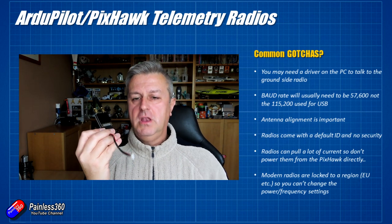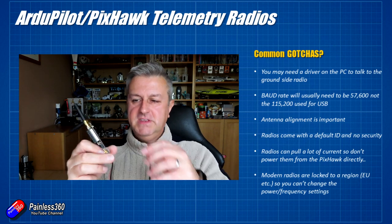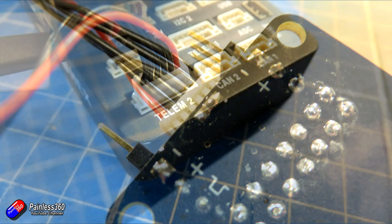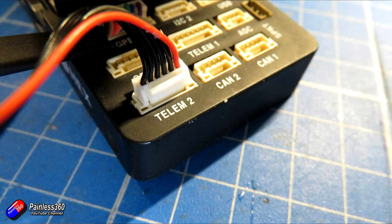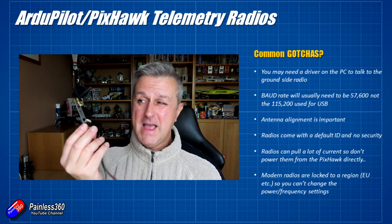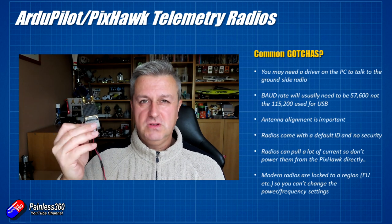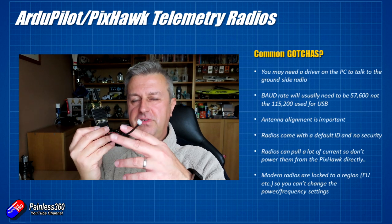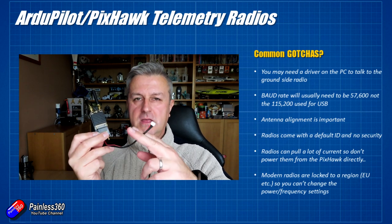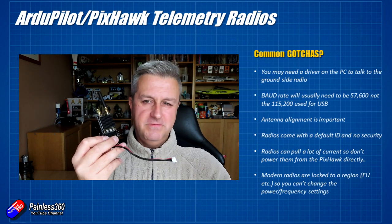Be careful — radios can pull a lot of current. The little cheap and cheerful radios you can probably get away with, but things like this you need to power separately. This board has the ability to use a power lead at the back, so rather than being powered directly by the Pixhawk, you can power it via 5 volts and ground from the output rail you're using to power the servos. You can get up to 800 milliamps into these at high power, and the Pixhawk and flight controllers are not designed to output that on top of everything else. So think about the power requirements — it's probably the most common problem I see, people plugging devices that pull a lot of current into the Pixhawk and expecting it to power amperes of peripherals.